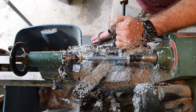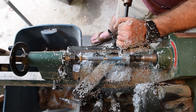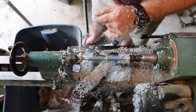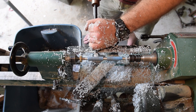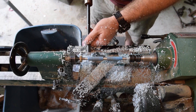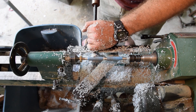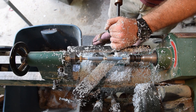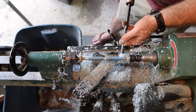The goal is to keep turning down until you reach the bushings — that's what the bushings are for. I continue to check it, stop, make sure it's round, make sure there are no flat spots left. I usually leave it slightly proud of the bushings so that when we go to sand we have a little bit of room, and when we finish it's perfect.